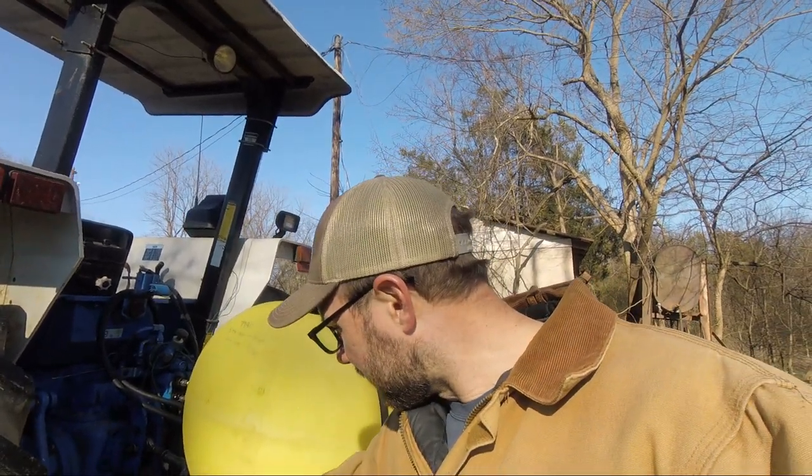Just to recap: I had exactly 10 gallons of water and now we've got exactly five gallons of water sprayed out. There are six blocks and my test run was half a block — that's what I can spray with this air blast sprayer, half a block at a time. So I sprayed five gallons on a half a block, I've got six blocks, that means I need 60 gallons.